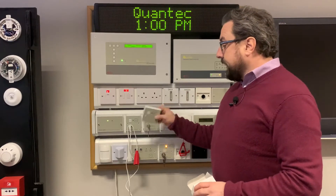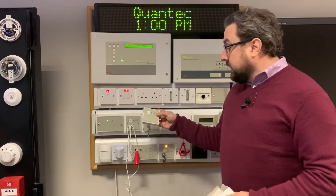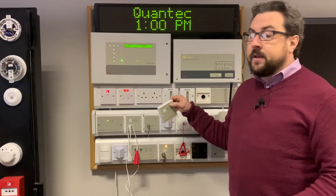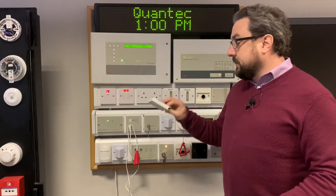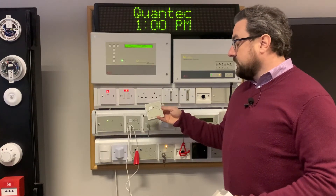In a lot of places they just standardize what they're putting in and the 602 goes in across the board, but if you have a lot of units where you just don't need that, or you're specifically looking at this from a disabled toilet or just monitoring WCs, it might suit you better to go with this. There's a small price saving to not have the remote socket on that.